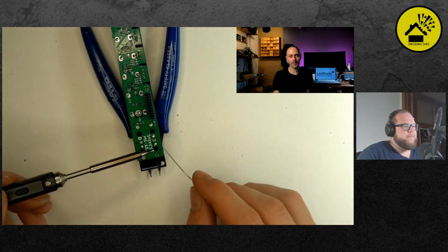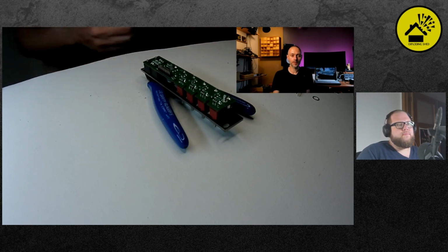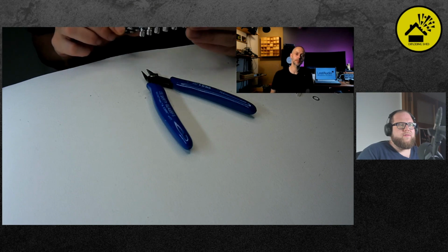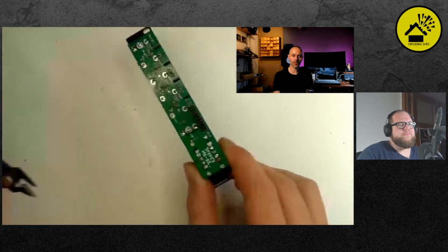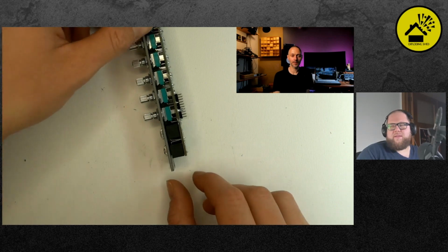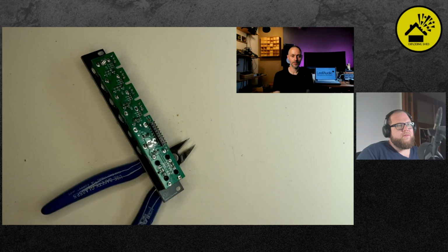And by the way, Manu, those switches are from Dailywell. Ah, yeah, they are nice. You can also get them at Farnell sometimes, then you don't have a lead time. As an engineer, I really like the trimmer. Yeah, the trimmers are good. Small, but good. They're very nice, but they're not cheap, unfortunately. And they're already knockoffs from Bourns. These are made by Nidec Copal, and they're basically a knockoff of the Bourns trimmers. Can't recall the model number. I tried them while calibrating, and they go very smooth and everything.